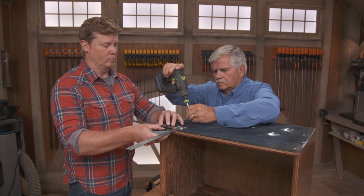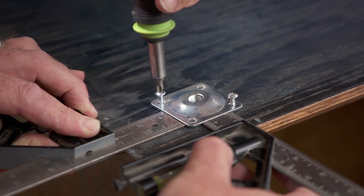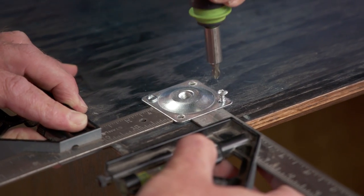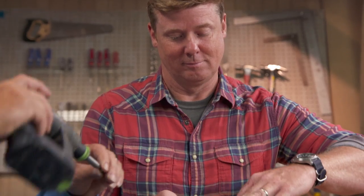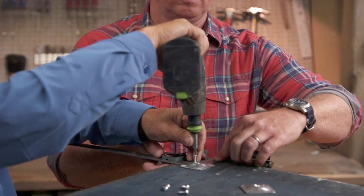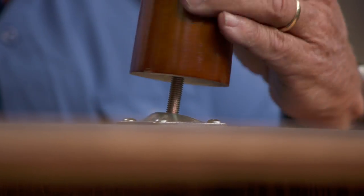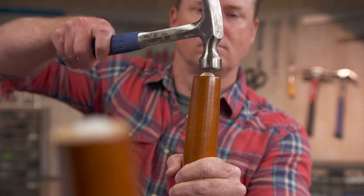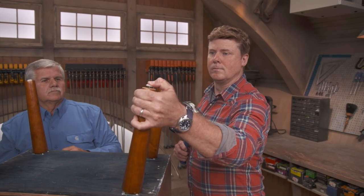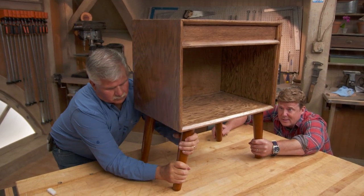Because the leg is going to sit at an angle on one side, we want to keep the bracket about two inches from the side and one inch from the front so it won't tip forward. These are pre-made tapered round legs — pretty common with the mid-century modern design. I got 12-inch legs because I want the cabinet to be at a certain height. I'll flip it over and we can adjust the legs.